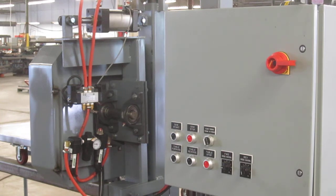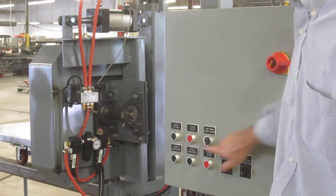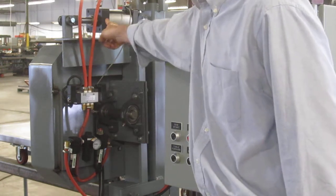For larger blades or very high production applications, we prefer to use a pneumatic blade tensioning system with an air cylinder. The air cylinder is controlled either by a manual or electronic solenoid valve. This machine is controlled by a solenoid valve, with a basic control system using a switch to control the blade tension. The switch controls the solenoid valve to control the air cylinder.